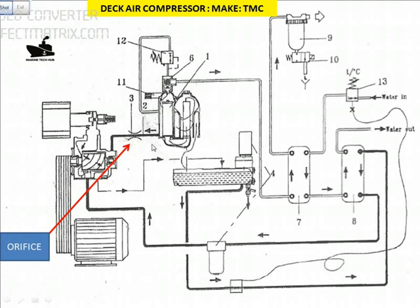I will explain why water came into the system. Looking at the line diagram, this is the oil cooler — you can see the oil coming from this chamber, running through here and coming out, then going here. We also have a water line, inlet and outlet — water coming in from here, going through, and out here. Water is used to maintain the temperature of the air and the oil so that oil and air are both cooled.